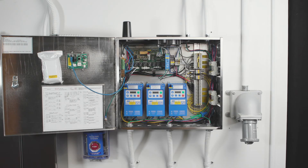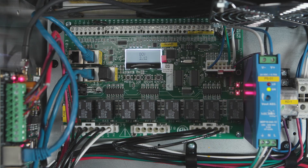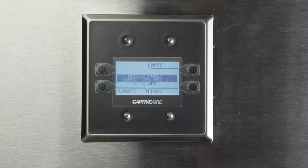Once you've verified that all wiring is correct, you can apply power to the control package. If you power up the circuit board but do not power up the VFDs, the HMI will show a Modbus communication fault. That simply means the circuit board can't see the VFD because it's not powered up and able to communicate. If you have a fan-mounted VFD, it will need to be powered up and a Cat5 communication cable run from the control package in order to communicate.